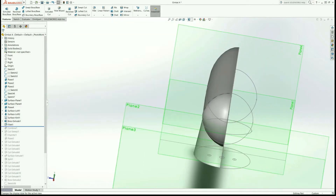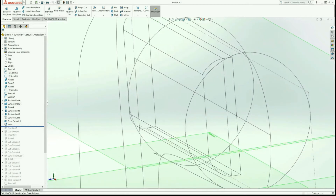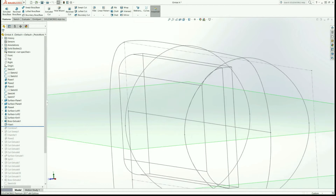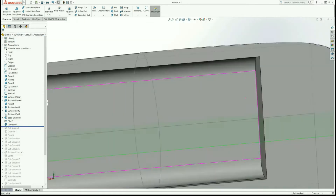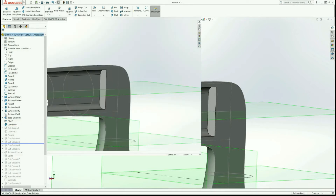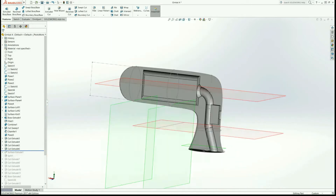The reason I did this as a solid body instead of just cutting away is because I needed round edges on the inside. I obviously could not achieve those round edges if the corners were poking out and making a hole on the surface. So I created it as a solid body and then combined — or subtracted — it, which made the cavity needed. I then made a couple more cavities for the wiring and a cavity for the switch.